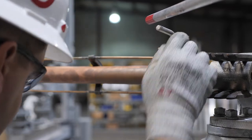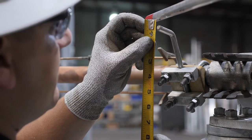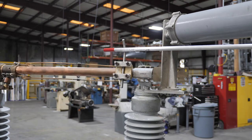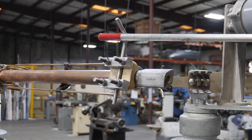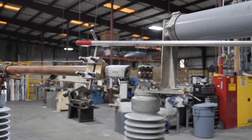Close the blade completely and open the phase to check if the pickup rod is engaging the actuating arm of the interrupter. Adjust the rod accordingly if required. The blade will rotate and lift the pickup rod to engage the actuating rod of the interrupter. The interrupter needs to trip just as the pickup hook approaches the red mark. Operate the phase five to ten more times to ensure the interrupter is functioning properly.